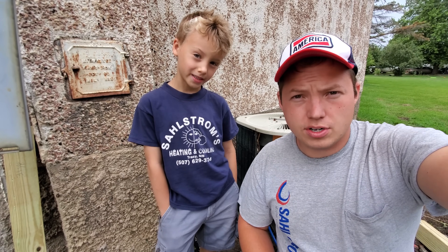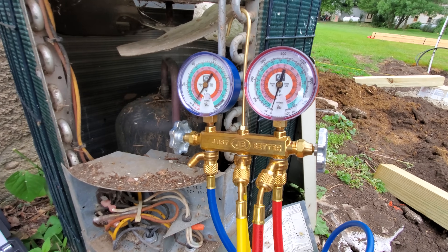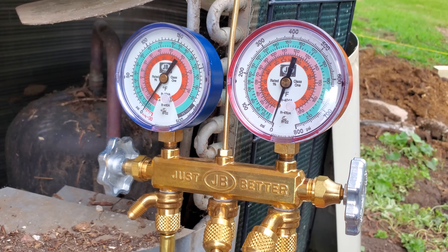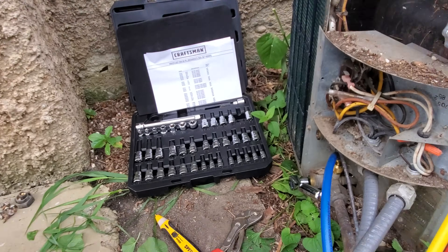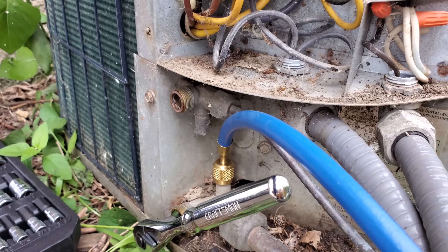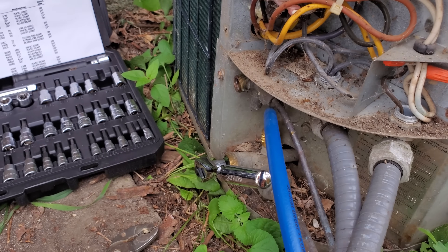I will link to the different tools you'll need for doing this, including a set of gauges. These ones right here are made by JB, which is nice. Highly recommend picking up a set of American-made gauges if at all possible — Yellow Jacket is another really good option. I'll put those in the description, as well as a set of Allen wrenches so that you can get those valves cranked down. The vast majority of the time the valves are going to look just like what we looked at today. Sometimes there are valves that have a stem sticking out called a king valve.